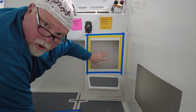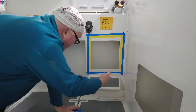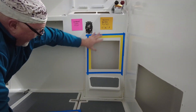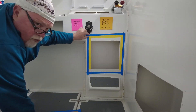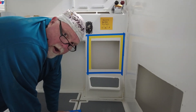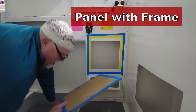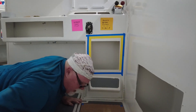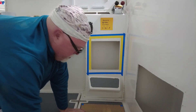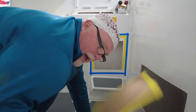This space right here is where the electrical panel is going to go, and all the wires will come from the electrical locker along this side of the boat and up inside here. The question is how big I can go, because when the steering wheel and auto helm are mounted there's a bracket that sits right here. I've taped things out to get an idea of where they'll sit, but there's an overlap, which is a problem. Testing the recessed frame template, I think the answer is that the recessed frame is just too big — it takes up too much space.